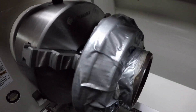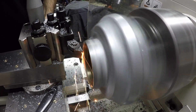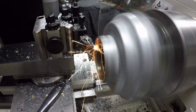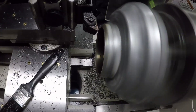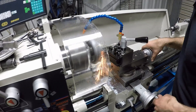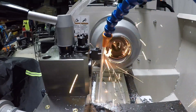Here's the gear - I've taped it up because there's a main bearing there that I really don't want to have to press off in case I damage it. You can see it hits against that face, so what I'm doing now is machining this back so it allows that to go in deeper. This probably doesn't look right to most people with sparks coming off, but that's a hardened face - that's just what happens when you machine hardened steel. I machine off probably a good three millimeters off that, then I'll put a chamfer back on it so the seals fit in properly.